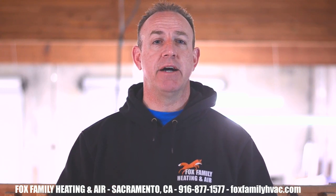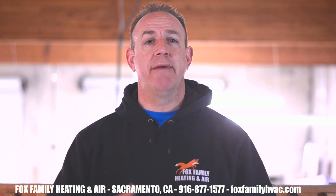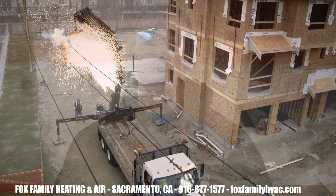When the unit gets placed, one or two installers usually have their hands on it, guiding it down to its spot while the crane slowly lowers it. Installers at this point have to watch that their hands don't get caught in the wrong spot under the unit. The biggest safety point to be made is make sure that there are no power lines in the area that you plan on hoisting and operating in. Make sure you have plenty of space between the area that you plan on working and the power lines.